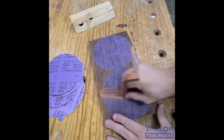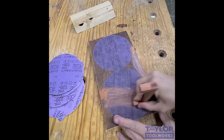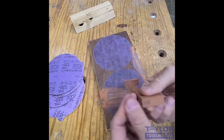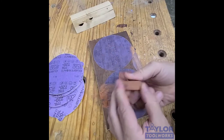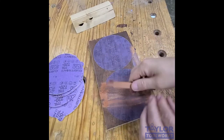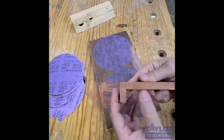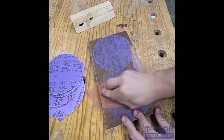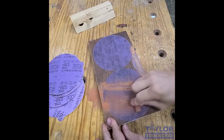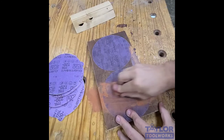Now I'm flat, so I go to the side and flip it around end for end. These six-inch discs are larger, which gives you a little bit larger surface area to lap on, which is really nice. I get that side flat, then do the other side, then lay it flat on its side and just lap it like that. Now I'm almost done with my rough sanding and can move on to the finer grits.